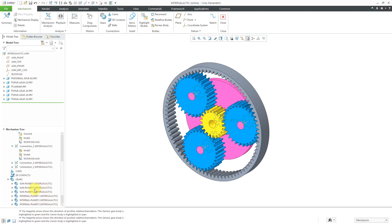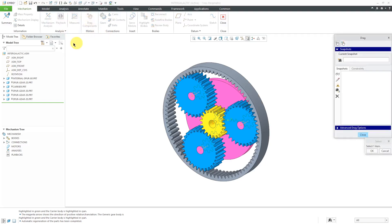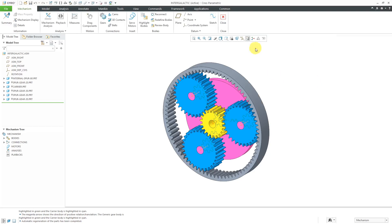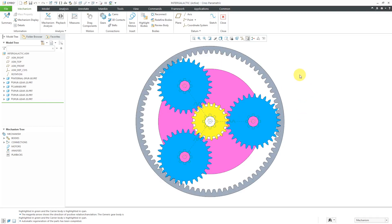One last thing — let's regenerate just so that I can get everything in my start position. Let's go to the drag button, create a snapshot, and I'm going to rename this to start so I can use it to quickly go back to everything placed in the right location, and then start doing some analyses. When you're doing a planetary gear, if any two of the moving objects — whether it's the sun, or the carrier, or the internal ring — are fixed, you're going to get essentially direct drive. If you have one of the objects fixed, that's going to determine what kind of motion you're getting, whether it's going to be a reduction, reverse reduction, or overdrive. We'll take a look at setting up those analyses and how to fix some of the different connections in the next video.